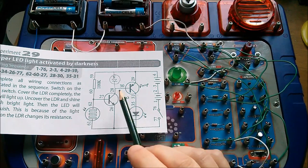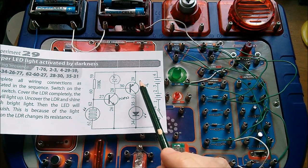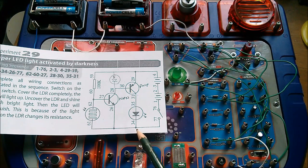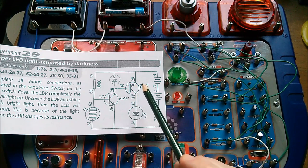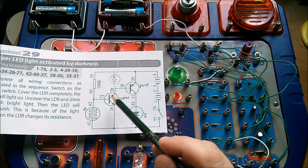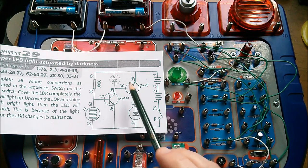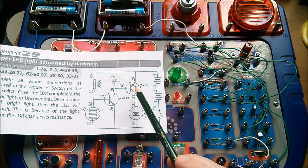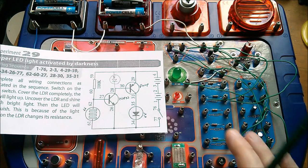Two transistors so that the gain of one is multiplied by the gain of the other — the gain of transistors being lower when they're in their saturation mode as opposed to active mode. I think I've learned that today. This sort of works a bit like a Darlington. The Darlington also of course has two transistors of the same polarity — either two NPNs or two PNPs. This isn't a complementary Darlington either — something called a Sziklai I think it is — which does use an NPN and a PNP, but it's not quite in this configuration.